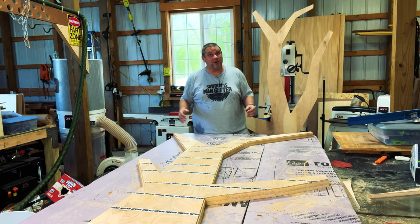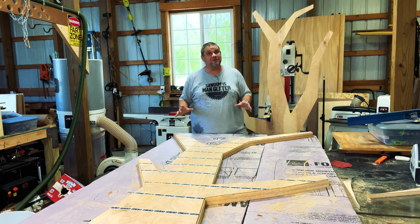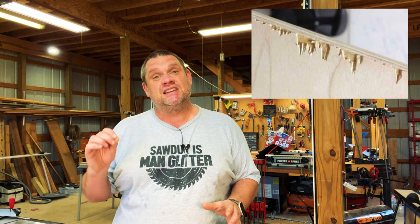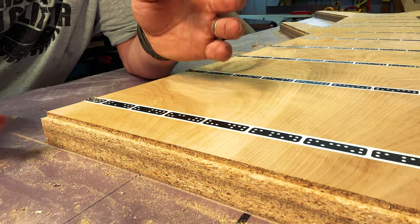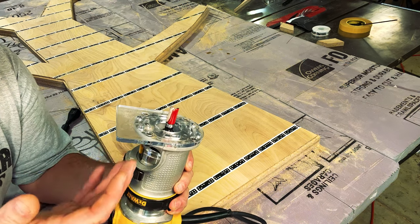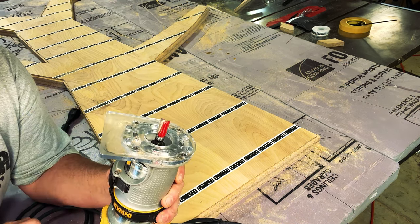That was a heck of a lot easier than trying to use a jigsaw around the exterior of each tree. You might be asking why didn't I just use a jigsaw to begin with? Well, if you've ever used a jigsaw, you know that can really cause a lot of tear out, and these things are going into school and they need very smooth edges. That's why we used the Shaper to make that template — the Shaper left a very smooth edge that we can rest our bearing on a flush trim bit and make sure all these edges are exactly the same. For this process, I'm going to be using a palm router with a flush trim bit and a top-mounted bearing. We're going to run that router around the edge of the tree, which will clean up the first tree so it's perfectly flush, and also create a lip on the second tree so we can make a second pass.